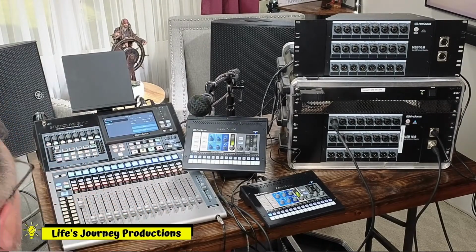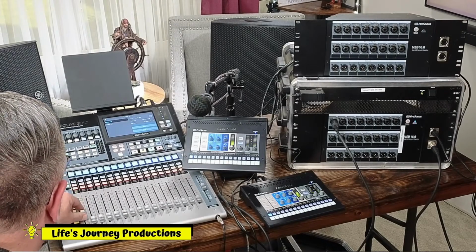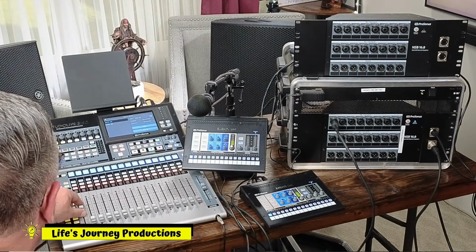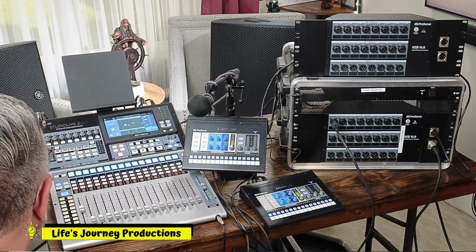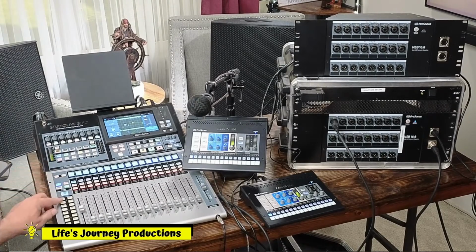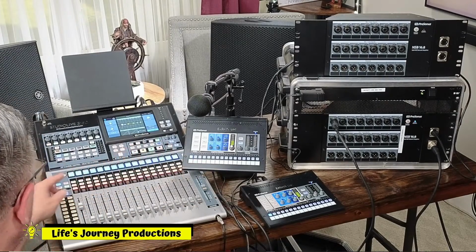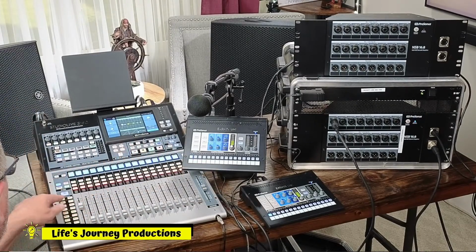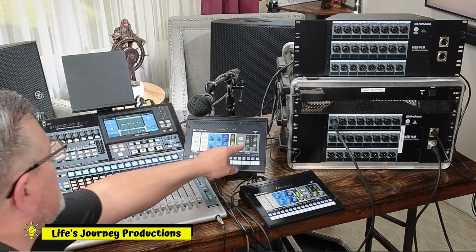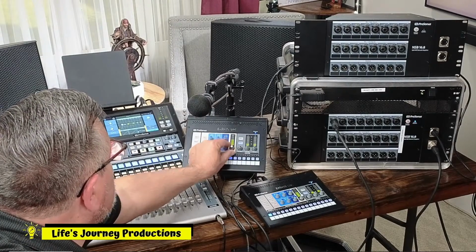And you can see right now I have a signal coming in. I just had feedback, but I do have a signal coming into channel 1. I'll click on select. You can see the signal right here coming into channel 1. And then if I go to mix 1, which is channel 1 on the in-ear mixes, I can assign channel 1 to that. I'm going to unmute it. And now I've assigned channel 1. You can see it's getting the signal. I can raise that volume to channel 1.